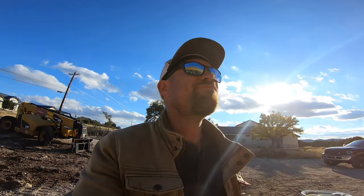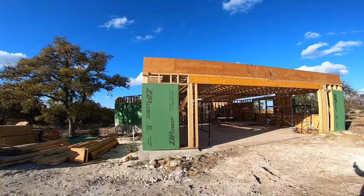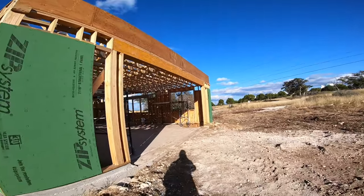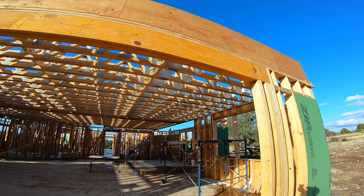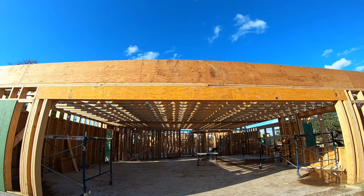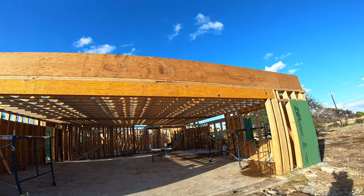It is the end of a good day. We were able to get the rest of our floor trusses up on the garage, as well as the LVLs on the exterior of the house. All the trusses are up, blocked off, and strapped off with the strong backs on the inside. We've got all our floor trusses done for the second story — 100% up. So tomorrow I'm going to throw up some of the subfloor material and start laying out that stuff.